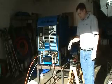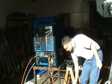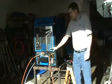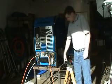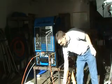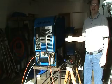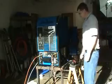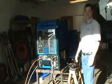Okay. And when we conduct this procedure, after we've purged the chemical system, we're going to spray our blower lube into the blower port, and then we will disconnect this recirculation hose from the inlet side, connect it to our wand, and flush all of this antifreeze solution that we can get out back into one of these containers. When we do that, it'll empty the water box and the machine will shut down against the low water float in the water box on its own. We won't actually have to turn the machine off until it dies, then we'll go ahead and shut the rest of the switches off.